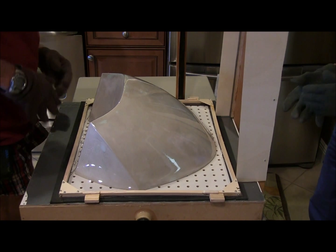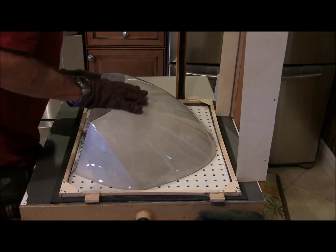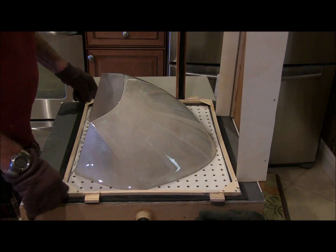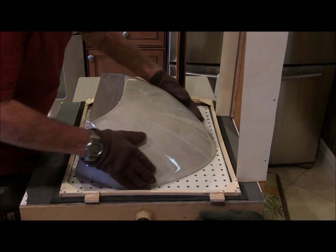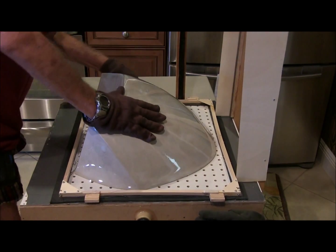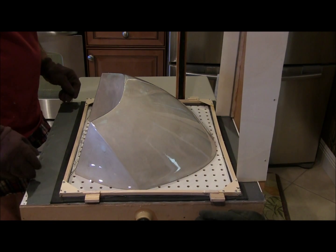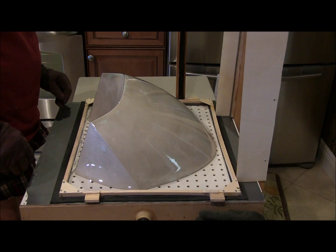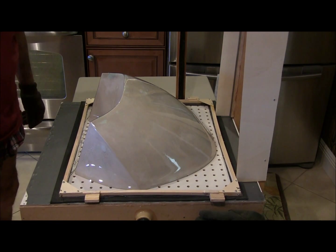Man, does that take a lot of pressure. But the plastic didn't get sucked to the side, which is irrelevant, but it looks to me like we got a good solid pull all the way around. Okay, pulled out some of my staples, almost broke my frame here — I'm going to have to beef that up a little bit. But I think I can use this one, it's got a good seal. No it doesn't — I've got a problem over here. I'm okay here, but I didn't get it all the way over here, it isn't down all the way. So we're going to have to put a little reinforcement on this frame and then see if we can get this heated up to a better temperature next time. Looks like I'm going to need a sag about this big to get this on here and get it to pull down all the way. Okay, that's live and learn.